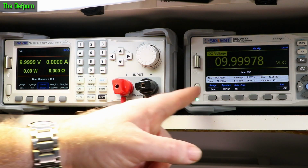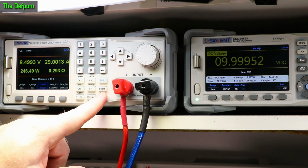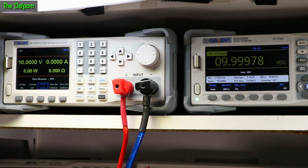Really volts. And as you saw, I did actually see a peak up in voltage there as it shuts off. So yeah, it just comes up very slightly. So it could be an inductive thing because I've got all these long cables. These wires are quite long, so it could be a bit of an inductive pickup there.